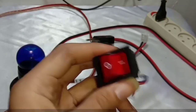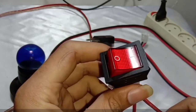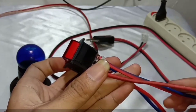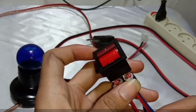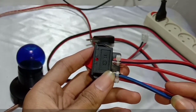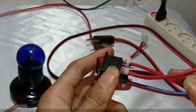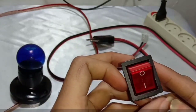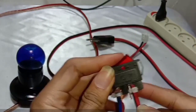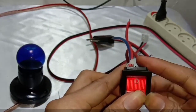Hello and welcome to my channel. What you see in front of you is a four-pin switch. We are going to wire this four-pin illuminated red switch. You have to pay attention to the wiring — the top two pins is for the input, you can see the circle sign, and the bottom two pins is for the output.